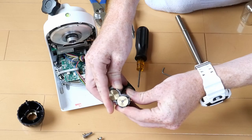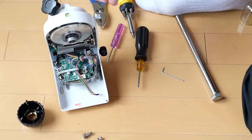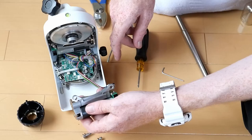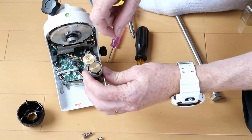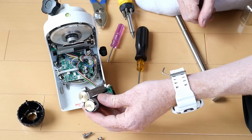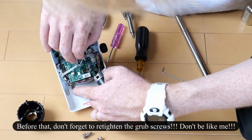Now those two gears are very well meshed. This is apparently the most common cause of backlash — the mechanical backlash you can feel when moving the counterweight bar is worm-and-gear backlash. The gear-mesh backlash is one you would actually see visually — guiding backlash. In RA it doesn't matter much, but in declination it definitely does. I did this for RA as well, just for completeness, though it's specifically needed for declination.